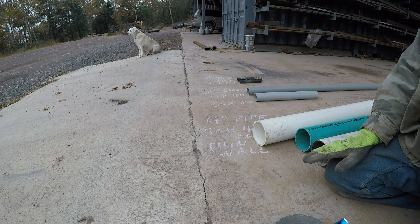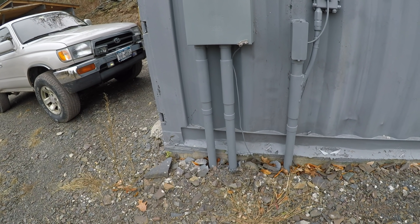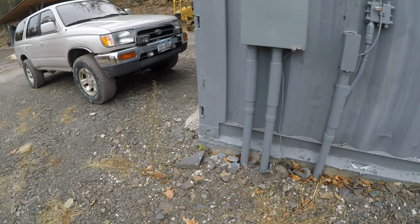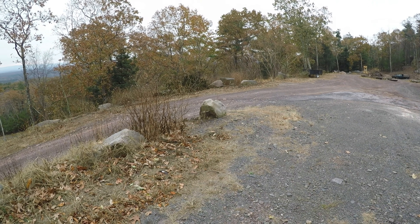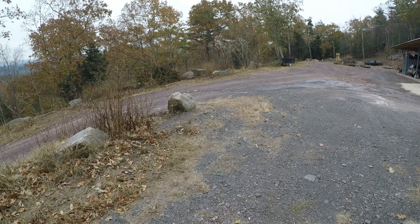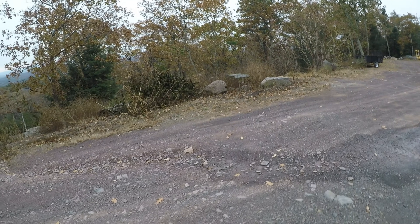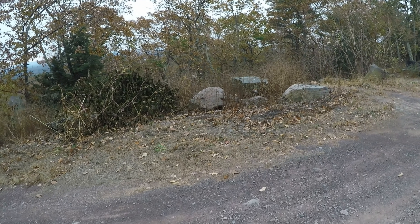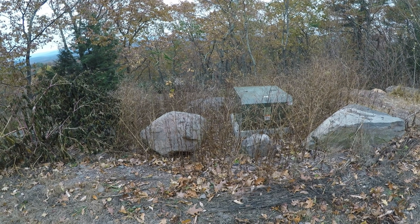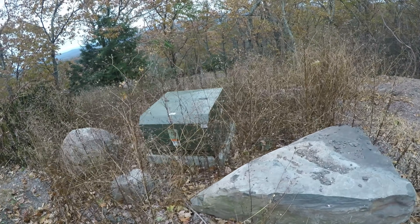You can usually see on the building a conduit or something sticking up out of the ground. Here's a good example of how to identify an underground utility line. You see a conduit going into the ground here — obviously it's going somewhere. This one's pretty easy: there's a transformer pad right there, so there's definitely a line going straight from the building to that transformer. And then there'll obviously be lines from that transformer to a telephone pole somewhere, so you've got to look for that, especially when you see a utility that's dangerous to dig up — you wouldn't want to dig up that primary electric service. That's high voltage.